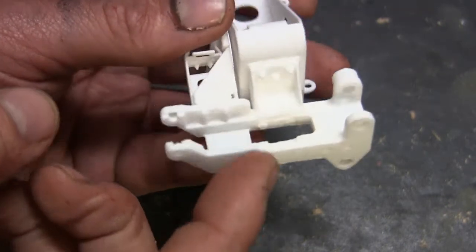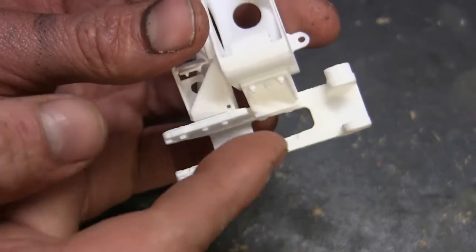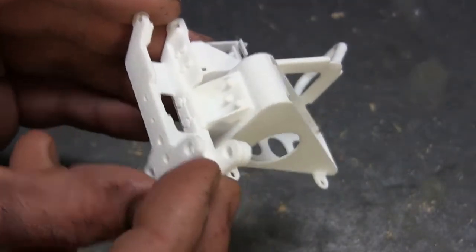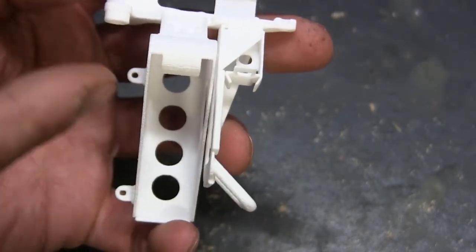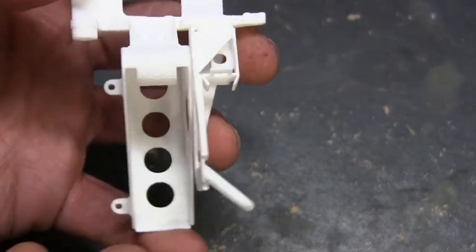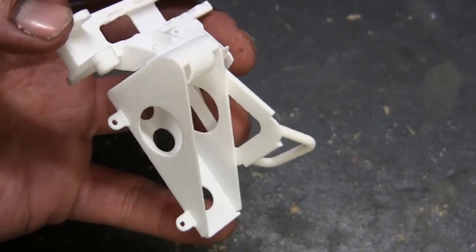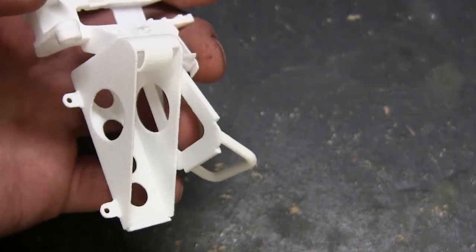This would include cutouts, sunken wells for fasteners, as well as other sections of geometry which really have CNC written all over them. Probably the most interesting portion of this cradle though is the ammo can holder. On this section here, we have the provisions for securing a 7.62 NATO ammo can, while directly behind it we have the provisions for mounting a 5.56 caliber ammo can. Starting with the .308 section, on the real unit it would all be made from stamped plate steel that would be folded and then welded to shape — and all of these attributes are present on the 3D printing here.